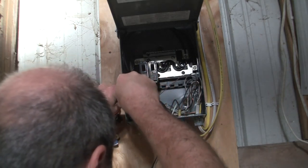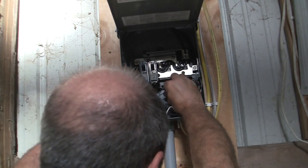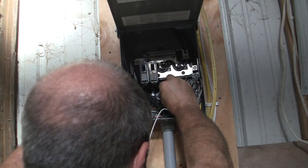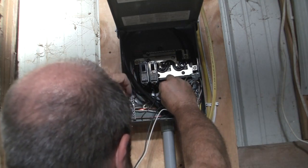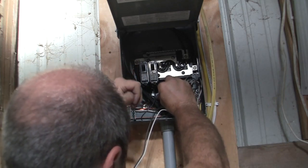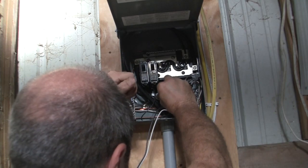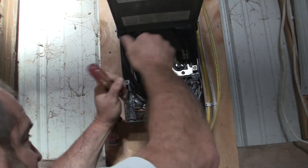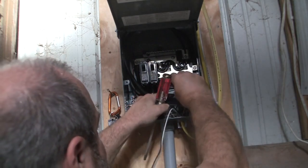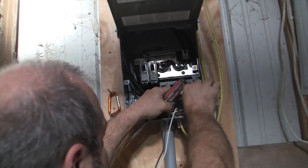All right, so just going to grab another hole here. And these things can all be combined onto one. I could put them all in the same hole. It doesn't really matter. The ground goes to the grounding bar. So if somebody ever tells you that circuits cannot be all grounded in the same bar or in the same hole or whatever, please don't believe them.